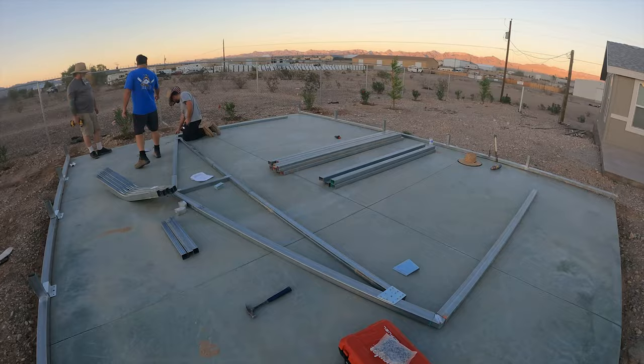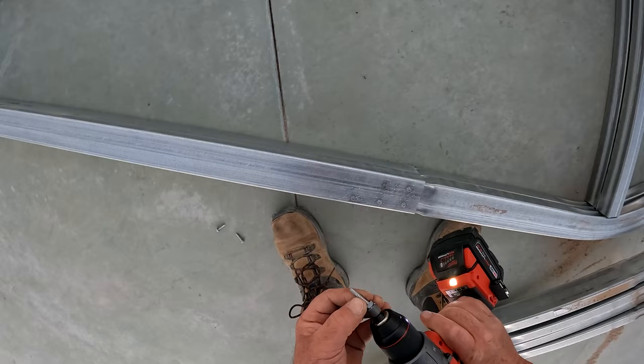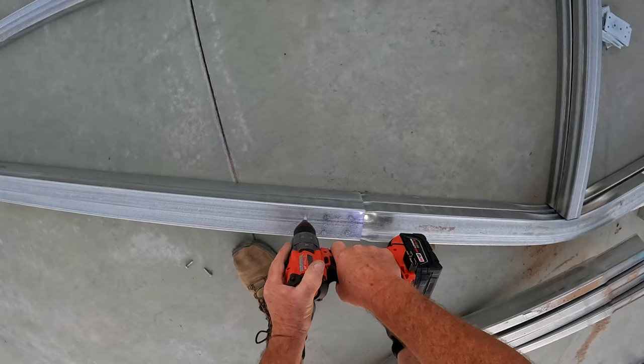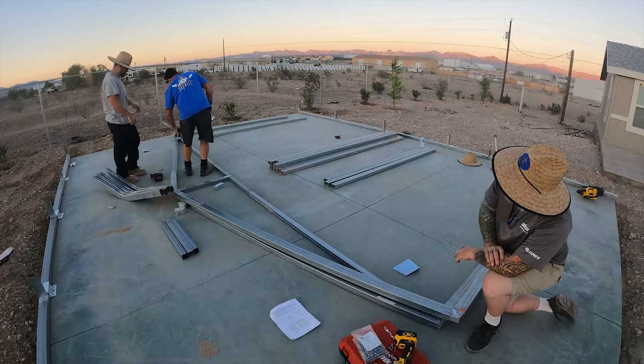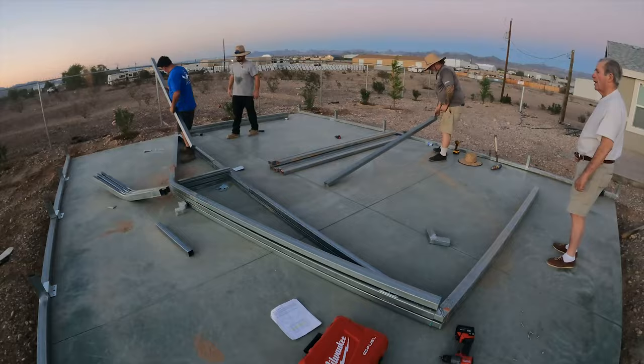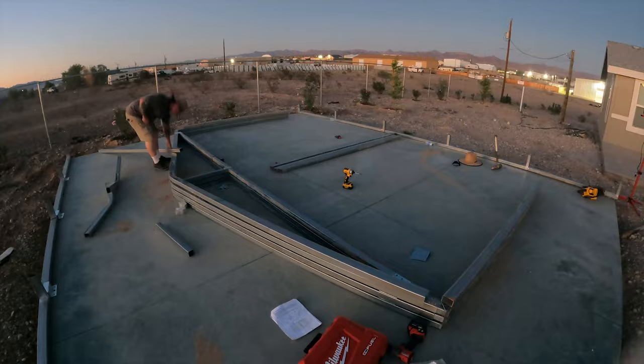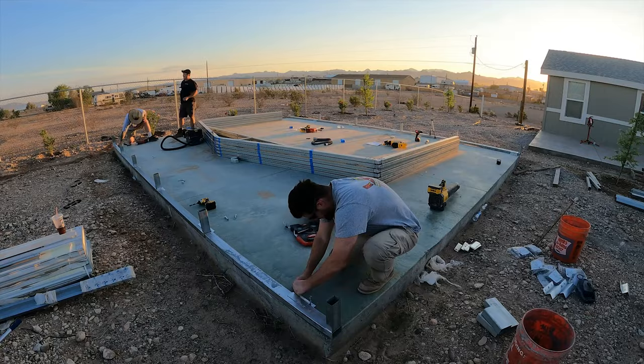We have a special inspection on those expansion bolts coming up — he's not due for a couple days, so we're going to keep moving on and just not put them all in at this time, just enough to hold it together while we assemble these trusses. The way these trusses are assembled, you can see they all slide into each other, then they're screwed in with 5/16 inch self-tapping screws. We build everything on top of each other so they're all built identically. When you stand them up on the little posts sticking up off the plate, you get a nice straight line. If they're built differently, you'd see that wave after you put the siding in — so this is a crucial step.